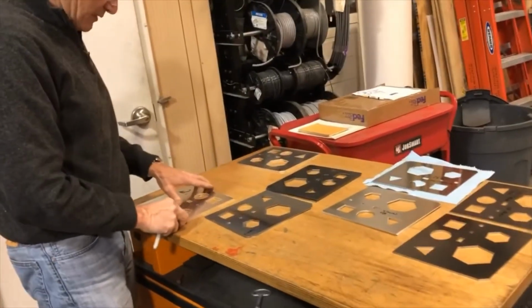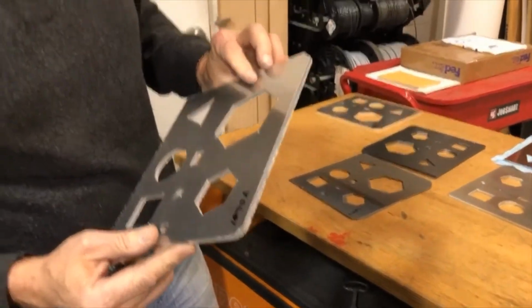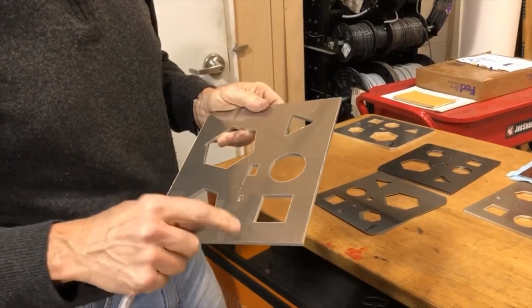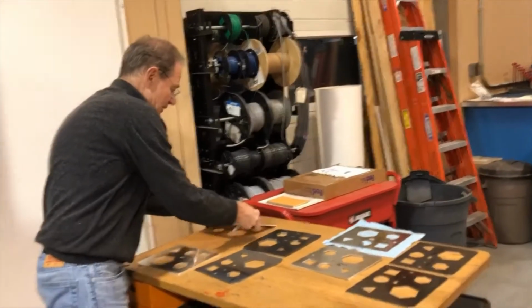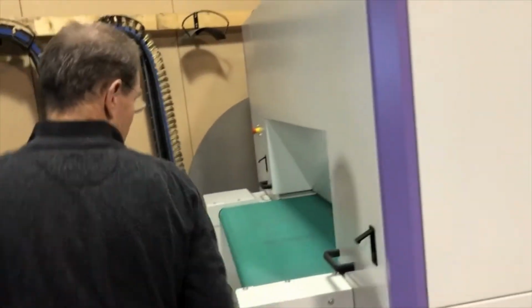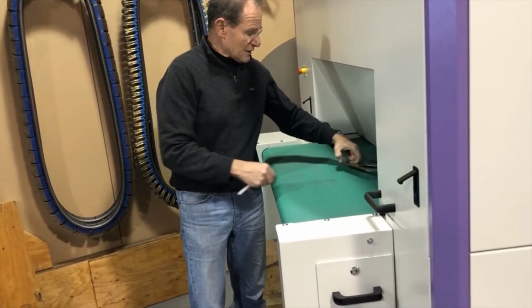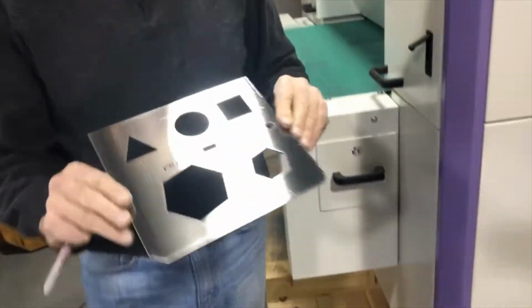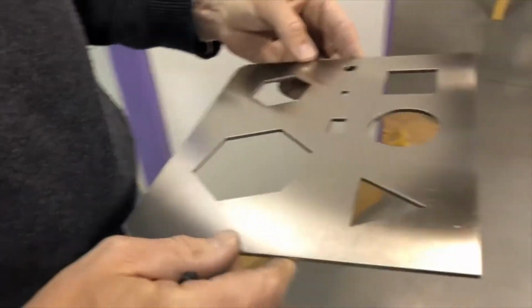Then we have the aluminum that has quite a bit of drop, but on this material I don't really see a grain. Yeah, no, there is a grain on this side, but I will show you what it is. It helps when you run the parts diagonal from the back side, in how the burr is then removed in the aluminum. So here on the stainless, same parameters as on the front, cross belt. And here, of course, this is the top side, great edges.